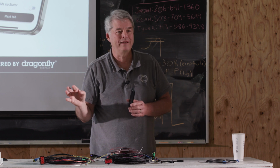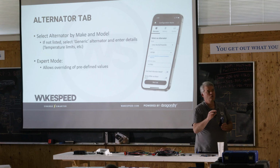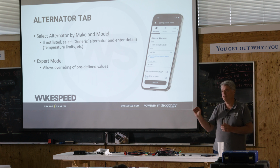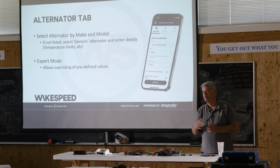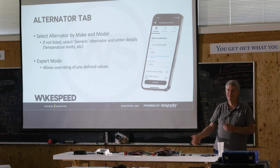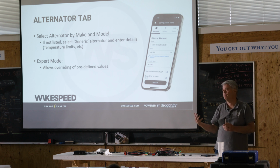Please only use that with lead acid batteries. You can fine-tune stuff with lithium, but it is super dodgy and super risky. Just tell customers, sorry, that's the nature of the beast, and find another solution for your tachometer. Move the tach wire to the ship's alternator, get a physical alternator, get a tiny tach, get something that senses off the flywheel, whatever it is, find another solution.